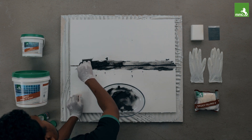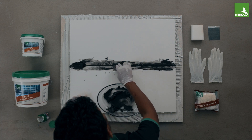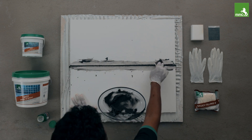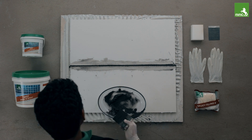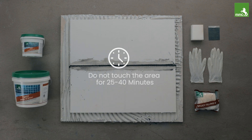Magic 2K Epoxy is mainly used in applications requiring high strength, antibacterial, and antifungal properties, and in decorative areas. Ensure that the joint is completely filled. Remove excess grout from the tile with a float, and ensure that the grout does not come out from the joint.